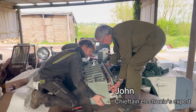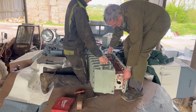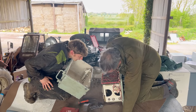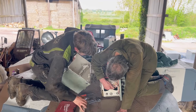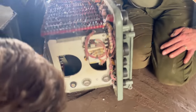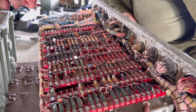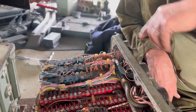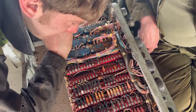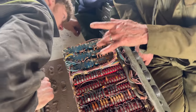Do you want to hold the front now and try and pull the back? Oh yeah, it's not looking good. Already not looking good. This looks very complicated. So your slug relay is this one here — traverse and elevation. That's a helpful place to put them. That's the slug relay? Yes, traverse and elevation. And that's the bridge rectifiers that give it its delay, which is why it's called a slug. On the top you have the traverse relay, elevation relay, and GPR gen-only relay.